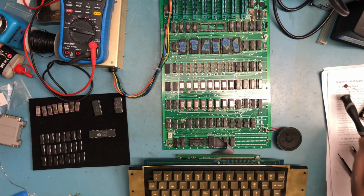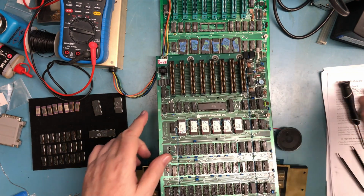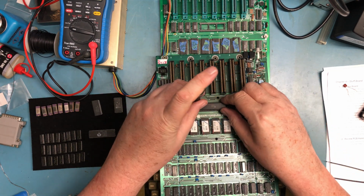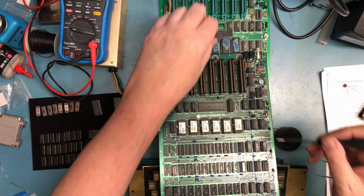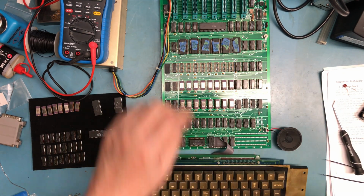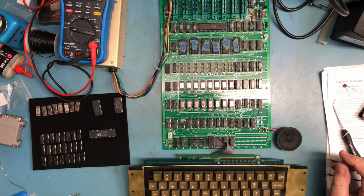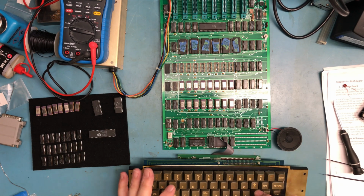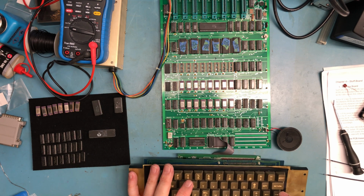6502 is out. I have the board that we rebuilt sitting right here. Let's go ahead and pop the 6502 out of it, although I seriously doubt this is the issue. That board has been tested and was working, so I expect the RAM and the processor from it to be good. It's in the correct orientation. We have a good prompt. So far, no syntax errors.